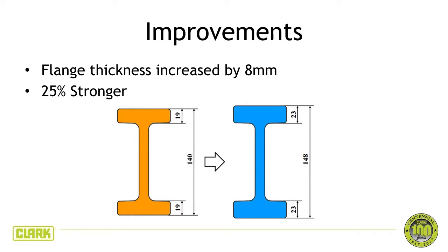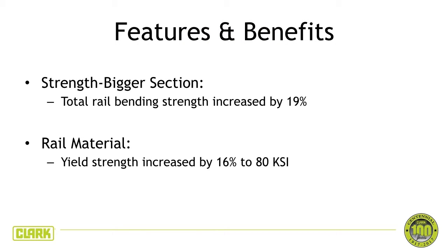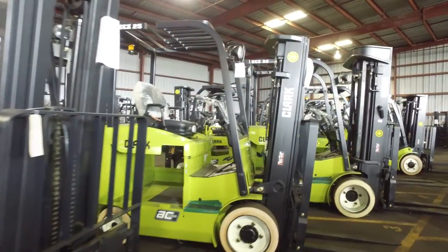What's new and different these days is we're introducing a new I-beam rail section. Some differences about that rail section: first of all, it's 25% stronger in terms of material — it's harder and has higher yield strength — so we end up with less rail flaking in tough applications, and the highest strength gets us where we need to go as far as life. The big deal, though, is the rail section itself is different. You can see from this picture that I've superimposed the new fatter section over the old version, and there's a circle shown here where it gives you an idea of the difference in what I call torsional resistance. This rail is actually bigger, and out of that we get less deflection both from a forward perspective as well as in torsion where it twists. You've heard me say many times before that Clark uprights are stiffer than the competition — well, in this case, the stiff just got stiffer.